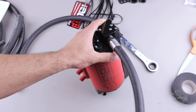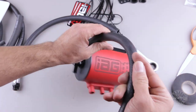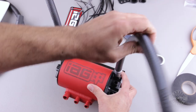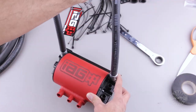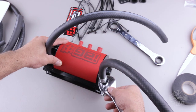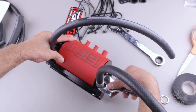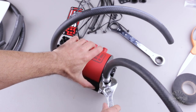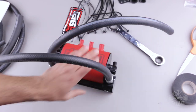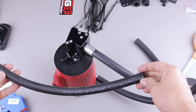Back at the workbench, start assembling the air oil separator. Grab the two coolant hoses — they're pre-assembled and identical. Put one in the upper opening and the other right below it, then tighten them with an open-ended 7/8 wrench. I didn't have that size handy so I used an adjustable wrench in a pinch, but I highly recommend having the proper 7/8 wrench. No torque specification is given, so use your best judgment and don't over-torque.